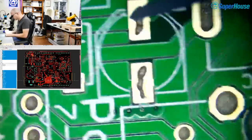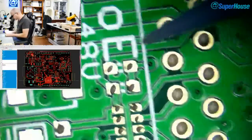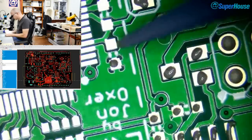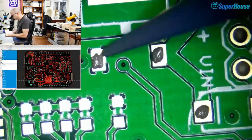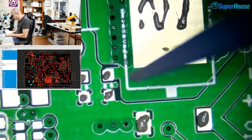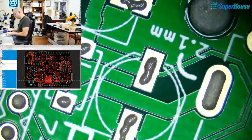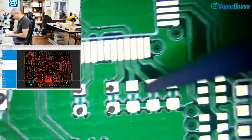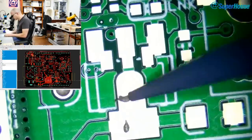Now, one of the changes for this version of the board, see that one there, that's a diode. Is it in your field of view? Yes, it is. And somewhere around, there's another diode. So there was some discussion on Discord about 2 weeks ago now. It was after I showed a previous version of this. And there was a discussion about isolating the power over Ethernet power source so that it couldn't be back powered. And it's something that I didn't do on the Ether 10. And in fact, the Ether Mega, the Ether Duo, none of them have an isolated back power protection on the PoE header. So what I mean by that is power can come into these boards from several different sources.